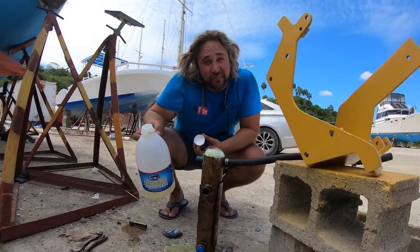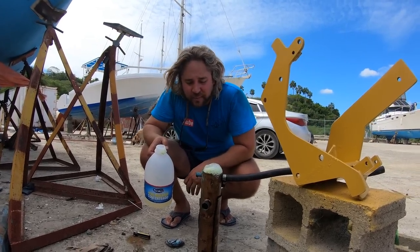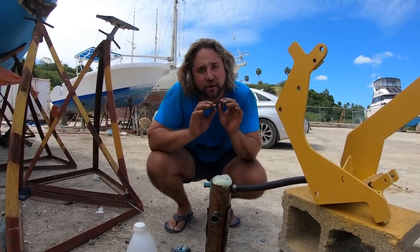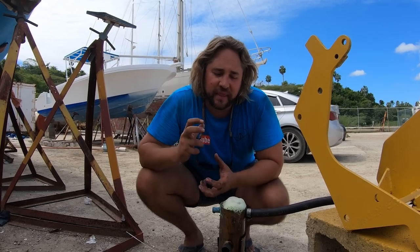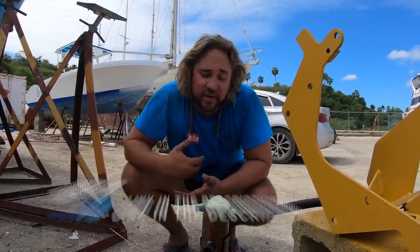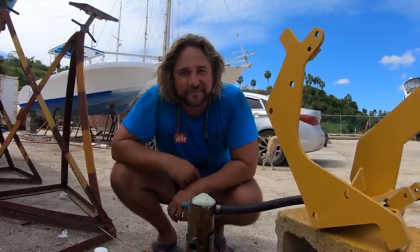What we have here is the newest cocktail on Magic — it's a muriatic acid cocktail. This is our heat exchanger. It's looking a little bit sad but I will also paint it nicely. What I'm doing right now is I plugged this hole and put muriatic acid in there to burn away all the gunk. A heat exchanger looks a little bit like a beehive inside — it's got a lot of little tubes. Water exchanges cold with warm, and the cold water goes towards the engine to cool it down. This is a very important part of the engine's mechanics because if it's clogged and not working nicely, you're overheating and might damage the engine. So we're cleaning it out and painting it nicely before it goes back in the boat. This boat is an absolute construction zone but I can't wait to get it on the water.